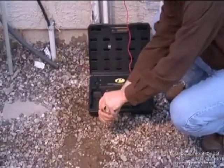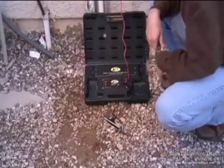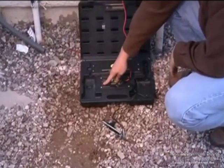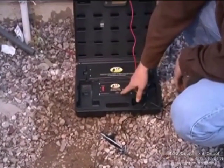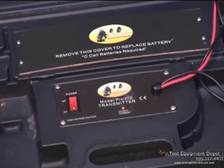Use the included ground stake to do this. Take the ground stake, connect it to the alligator clip, shove it into the dirt, and get yourself a nice ground system. Turn the unit on, and by looking at this red LED, the brighter that LED is, the better your ground is. You have to have a good ground for this to work well.